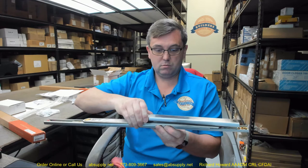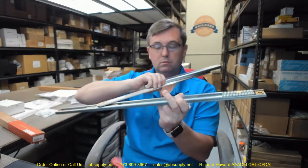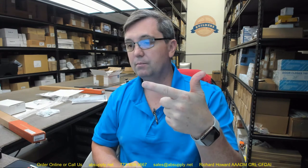Now let them go for a moment. To the right of the illustration we determine our point of reference: what is the door hung on? Center hung pivots, butt hinges, offset pivots, or swing clear? Step 1A: determine mounting being used. Step 1B: select the mounting group from the chart below. Most continuous hinges are grouped with 4.5 inch wide butt or 4.5 inch swing clear hinges. Step 1C: using the mounting group number and the overhead stop size, find the A, C, D, E, and L dimensions from the chart on page 3.